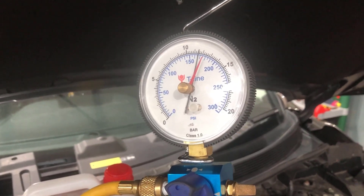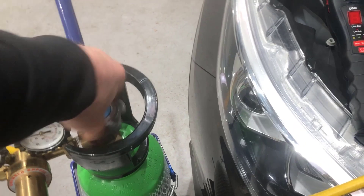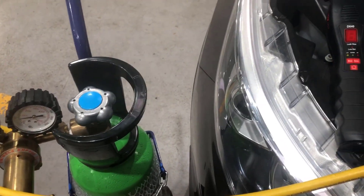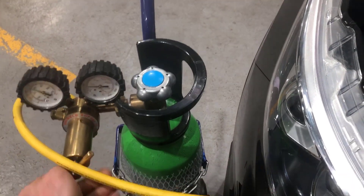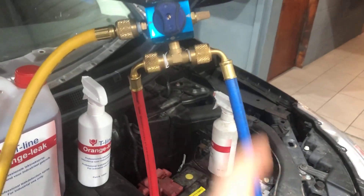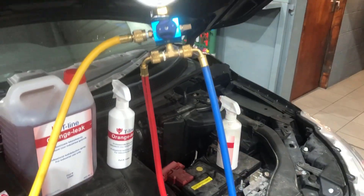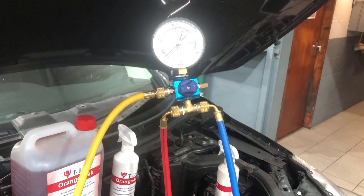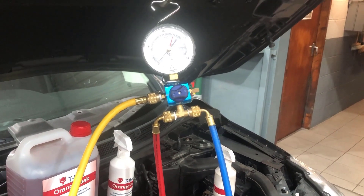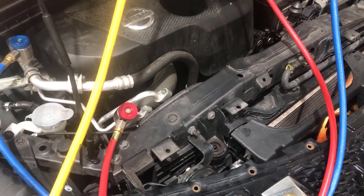Finally, we disconnect everything from the vehicle, shut it all off, and let the nitrogen-hydrogen mix that's in the system vent out through the breather. That's it — disconnected. This vehicle needs to go ahead for a repair: a new condenser, and then a refill of the system afterwards.